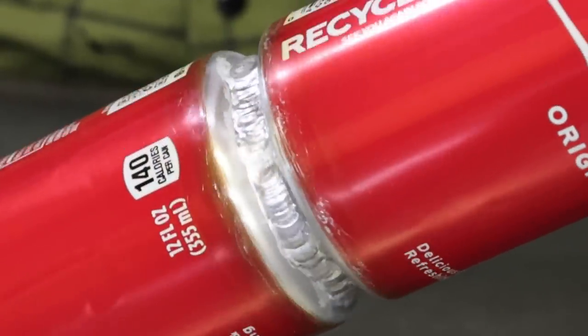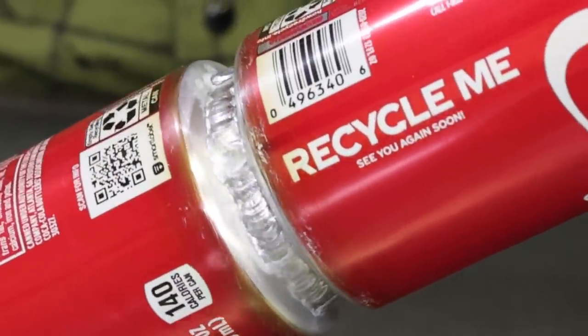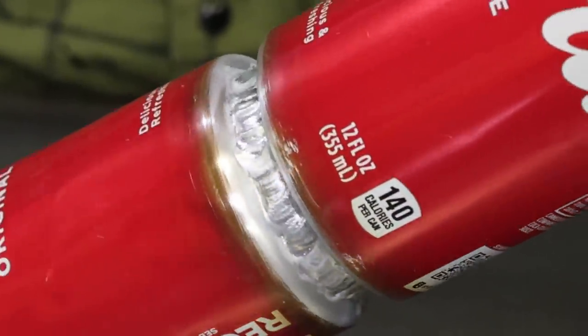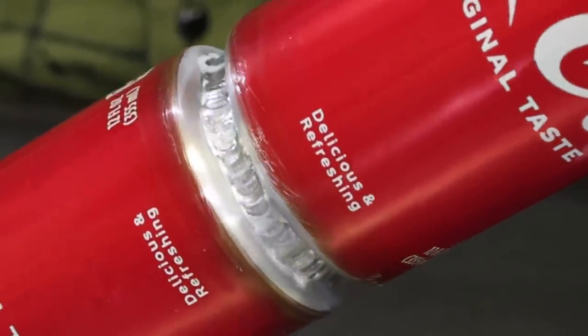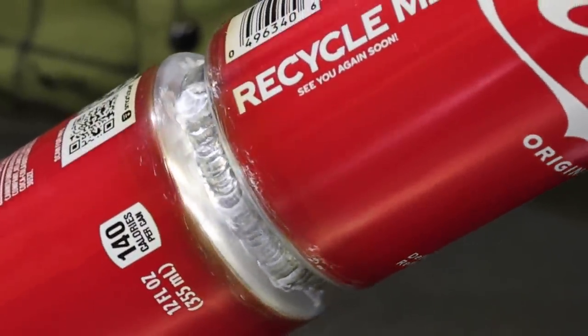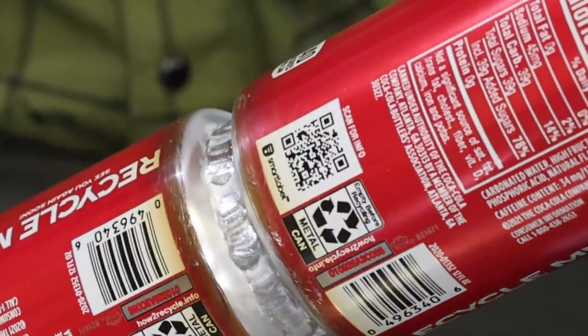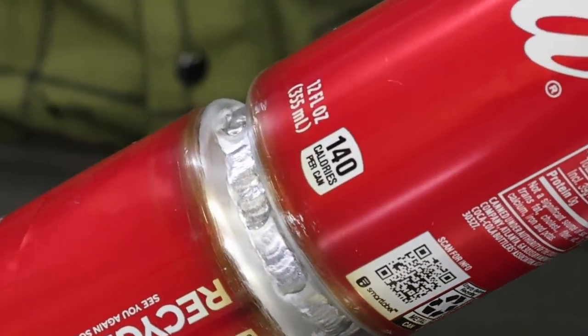The arc is always gonna be a little unstable doing cans — for me anyway — probably because I didn't clean it enough. If I had taken some sandpaper and really buffed these things down, then Scotch-Brited them and wiped them down with acetone, I could probably get a better bead. But for what we're doing today, you guys wanted cans — here's a nice set of cans.